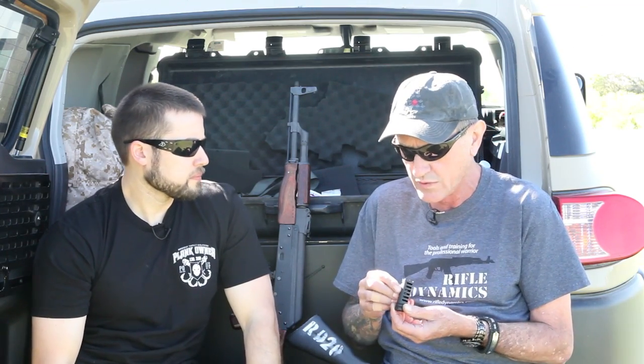If you look at this, it's designed much differently than any comp we've seen before. It actually has an inner sleeve. Before you guys start thinking suppressor — no, it's not. There are holes in the inner sleeve as well as the outer sleeve, so it doesn't qualify as a suppressor in any way and it doesn't reduce noise. What it does is divert gases properly, and it was designed based on the characteristics of the 7.62x39. The vents and the angle of the vents are all part of the science of how this works.